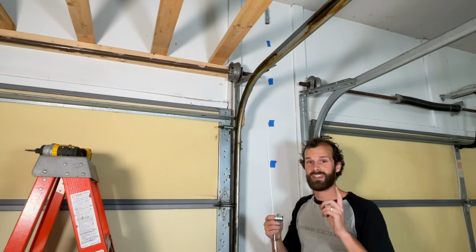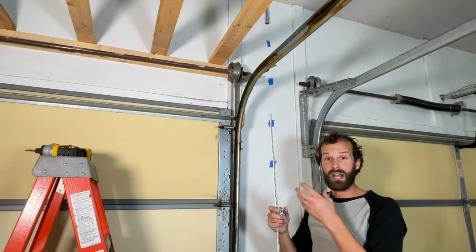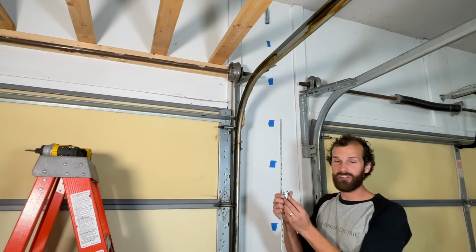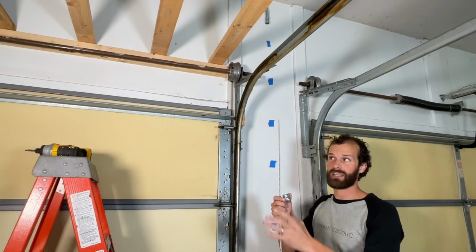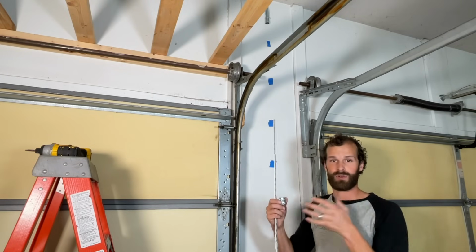Now this is very important. When you're using a metallic conduit system, the conduit itself is actually part of the grounding system. So you want to make sure that every set screw, or if you have a compression type, every compression ring is snug so that the electrical conduit would never become energized but would be properly grounded.